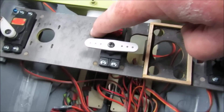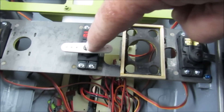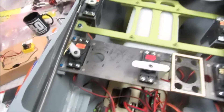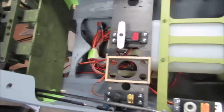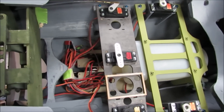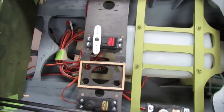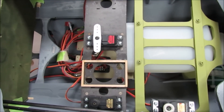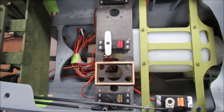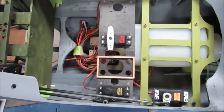There are still things I need to mount here, and I haven't quite figured out the final configuration. But this is the servo for the tail hook, that is the tail wheel steering, and that is the rudder — so those have been mounted. That more or less completes everything I know about what goes inside this fuselage. There are still things I don't know — lots of wiring, maybe gyro stabilizers, and I obviously don't have a receiver in here. But that's it for now. I'll start another video to deal with the engine mounting and all the stuff that goes inside the cowl.